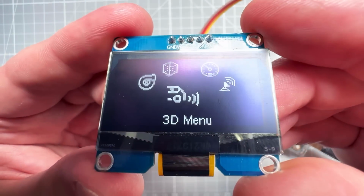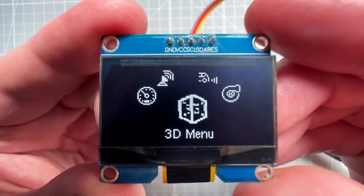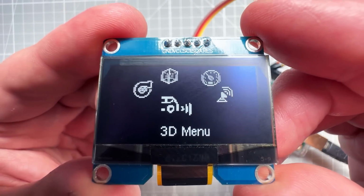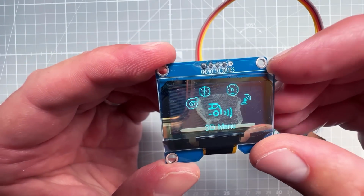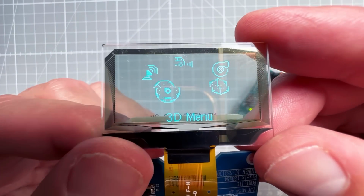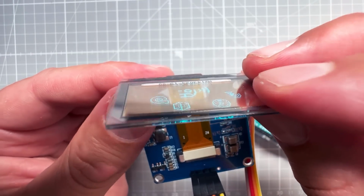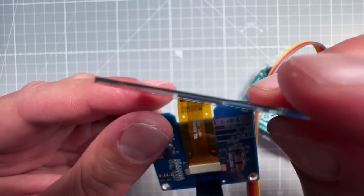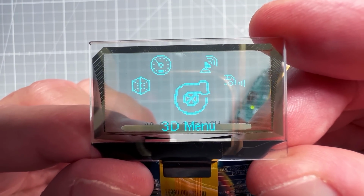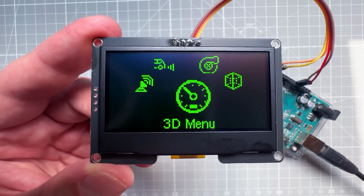I'm really happy about how this project turned out, but obviously at the same time, there is quite a lot of stuff that we can improve and add, like changing the label based on the selected item, calculating the 2D position instead of using the lookup table, so you can have more icons or less icons or whatever number of icons that you want, to using a more powerful microcontroller, for example something like ESP32, so we can maybe even do the resizing of those icons on the MCU instead of doing this inside After Effects. I would like to try all of that, but most likely in the next video. Today it was more about the proof of concept and making sure that something like this is indeed possible.